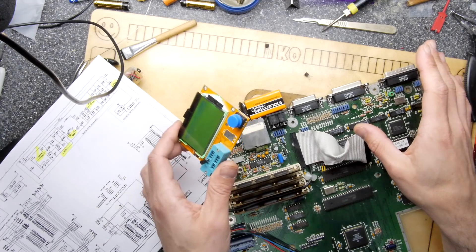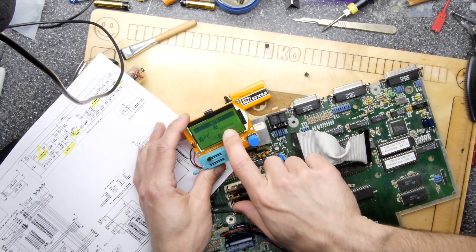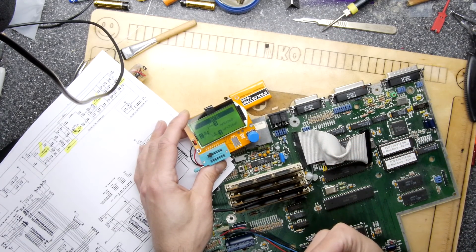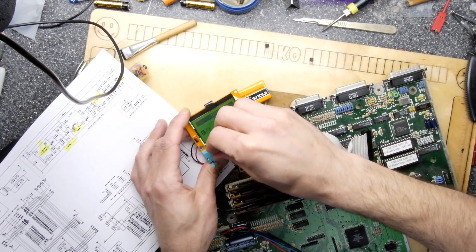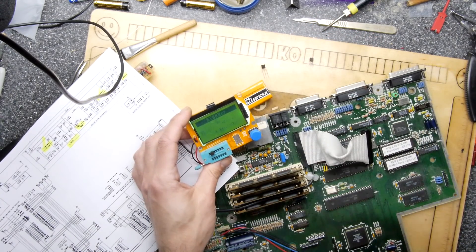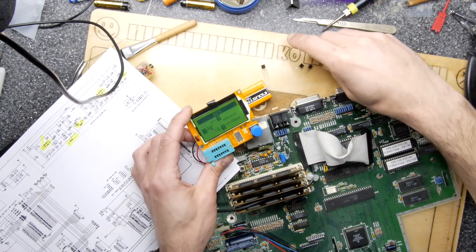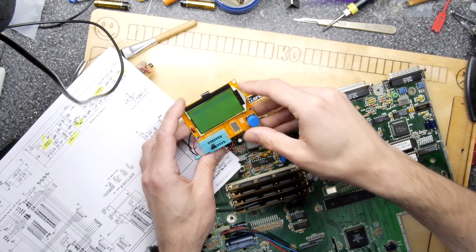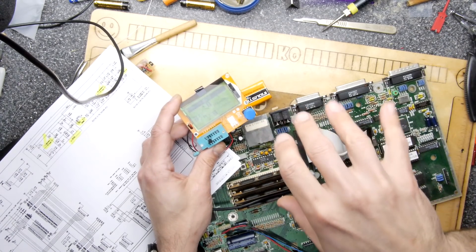So I'm going to check the transistors that are on there, but actually I'm replacing them anyway. The ones on there have an HFE of 268 and a Vf of 724 millivolts — they're basically a 3904 transistor. The other transistors on the shelf look okay too: HFE 214, Vf 705mV. But I'm replacing them with fresh ones that have a bit more gain: HFE 413 with a Vf of 715mV. A little more gain probably couldn't hurt.